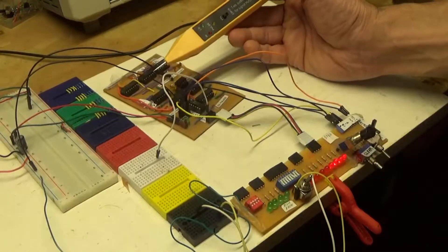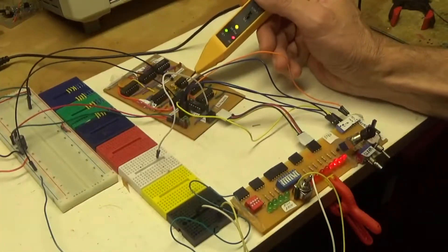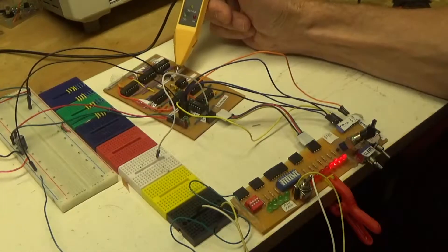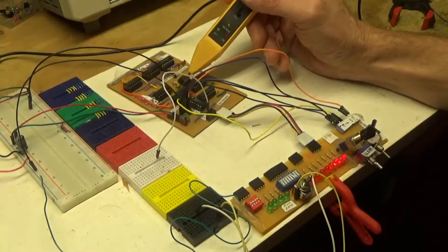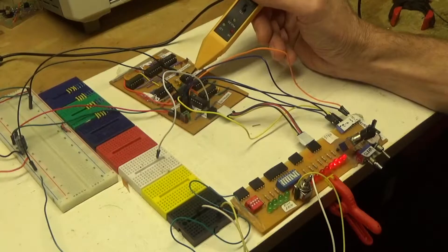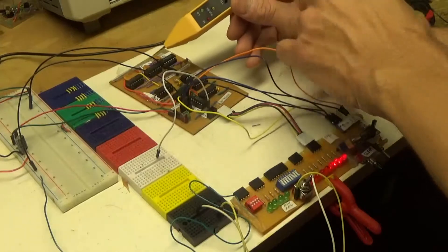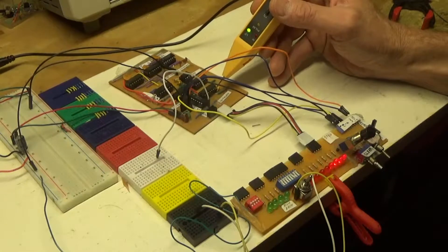Let me give you an example. We've got the 555 timer running, so let's go to pin number 3 - you can see the pulse, that's working. The power is on pin 4 and pin 8, that's correct. Let's see if the ground is correct - the ground is showing low. There are different sounds depending on low and high, and different sounds based on the amount of current or voltage on the line. There's also a memory pulse playback which I think can record a sequence of highs and lows then play it back - I haven't tried that yet. Let's test all these other ones and see if we've got a good ground in every one of them.